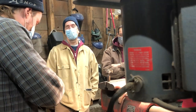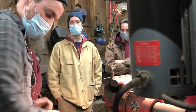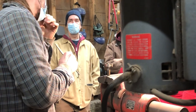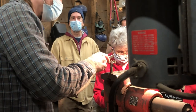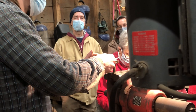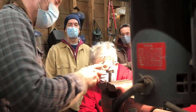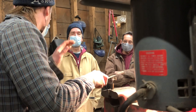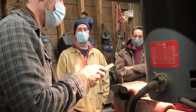Also, sometimes files have teeth along the edges, and on other edges they have no teeth. If you look at this needle file, there's no teeth along this edge. If you dig out some of the files in those drawers, you'll see variations. So if I've already filed this face, and now I take the file and go like this, the teeth are going to be cutting into this face that I've just sharpened. But you can use the face that's here as registration to get all the way into that corner and not be changing the face that you've just filed.